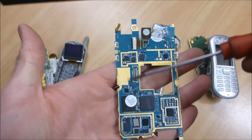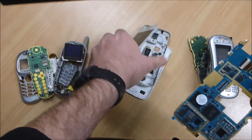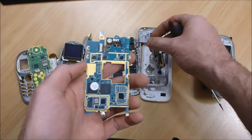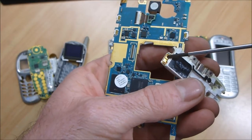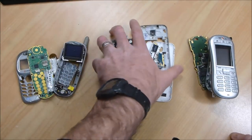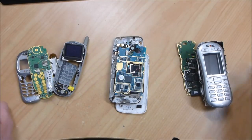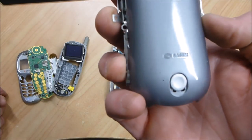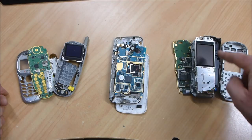This Samsung is probably a bit more like what we're used to seeing on modern phones - you appear to have quite a lot of gold plating, but I'm going to bet pretty good money that this is going to be super thin ENIG, almost worthless from a recovering-the-plated-gold point of view. I'll also check at the same time the bottom speaker part, which has a couple of gold plated connectors that are probably going to be hard gold. That'll cover a fairly up-to-date smartphone.